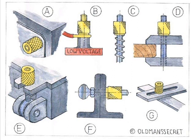A pair of steel lugs are welded to the framework with an eye bolt fitted between them by means of a pivot pin. The cover has a slot as shown, through which the eye bolt passes, being secured by the knurled nut. When the cover is to be removed, the nut is slackened, allowing the eye bolt to swing away from the cover on the pivot pin. As it drops down at the side of the frame, the cover is lifted off.